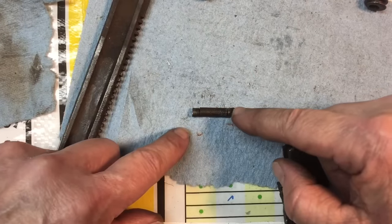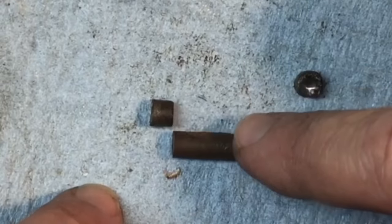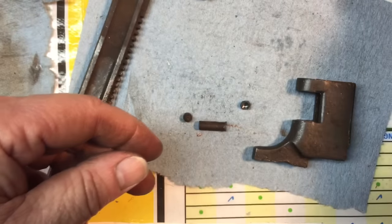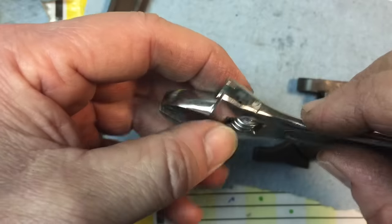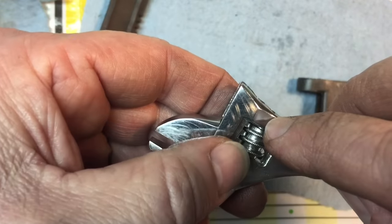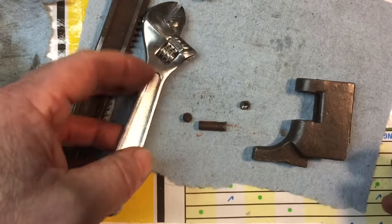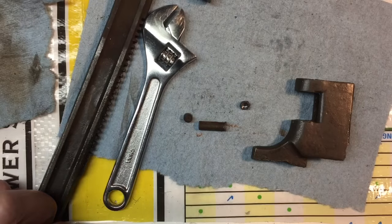So here was that nightmare pin — you can see we drilled into this end, that didn't work, so we had to cut it out, and there are the three pieces. It's clear now and you just have to clean up. We have an extra knurled ring if we ever need it. When you have a crescent wrench, you won't be able to get in there too much with the Dremel from the side because of the space restriction, so you'll have to do all your drilling from the top. A left-handed drill is great. Once you get past that peened area, you're home free. I hope that helps out — just look at these not as problems but as a challenge. Thanks very much, take care, hope this helps out.